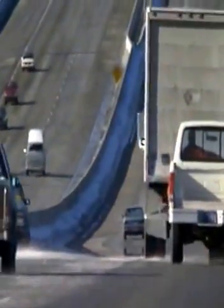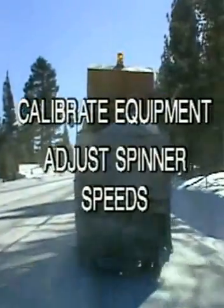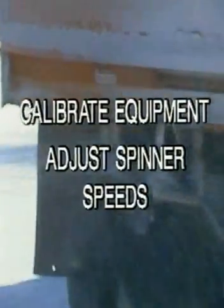CMA-treated surfaces often appear darker than salt-treated road surfaces. The mechanics of dispensing is fundamentally the same as applying road salt; however, it is very important that the equipment be calibrated for CMA. Spinner speeds can be adjusted to give adequate coverage depending on application rates and snowplow speed. Because CMA is lighter than salt or any other chlorides, you need to slow down the spinner speed — otherwise the pellets will just bounce off the road. You close down the gate in the back as well, but you can still apply the rates needed to be effective in the snow.